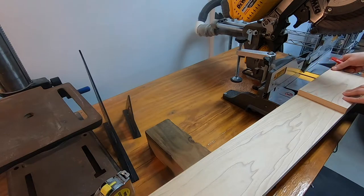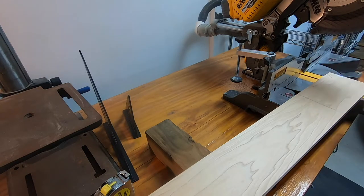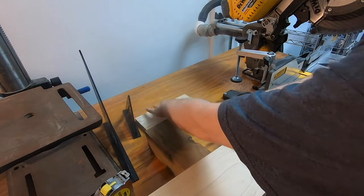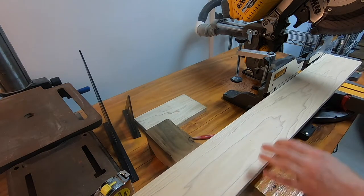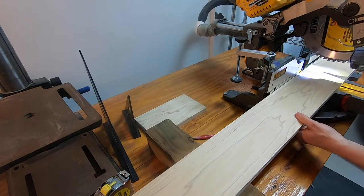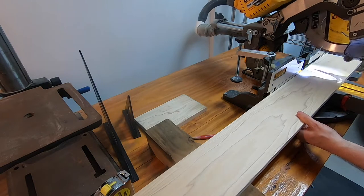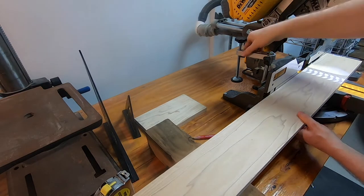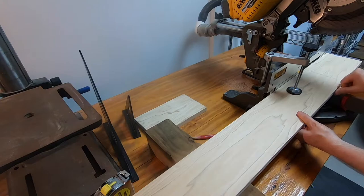after doing this. I'm going to use my miter saw to cut these pieces, but I highly recommend whatever saw you have to learn all the safety features and learn how to secure the board to it, and use your eye protection, your hearing protection, and dust collection and all that stuff when making the cuts. Most importantly, just keep your hands away from the blade, and anything that doesn't feel right, consider what the setup is and doing it a different way.